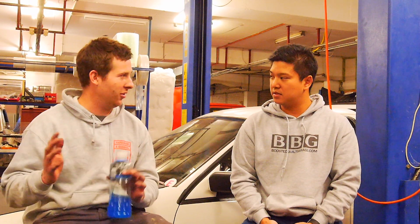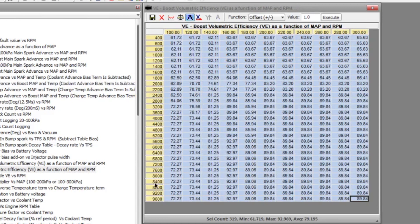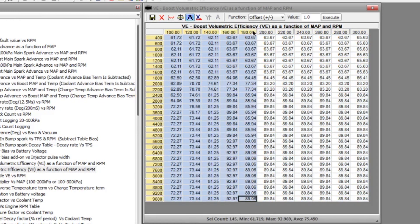The tables are pretty high resolution. The factory code is pretty much mapped to 4800 RPM, but in this code it's defined all the way to 9600 RPM — so if you've got a high-revving engine, you've got much finer control over how it behaves throughout the rev range. The tables are heaps bigger, so you can have really fine control over fueling and spark. There's also a soft-cut rev limiter — it starts to retard the timing to slow the engine down as it approaches the rev limit.